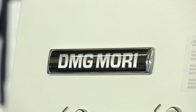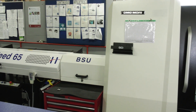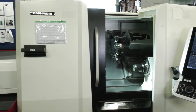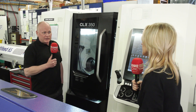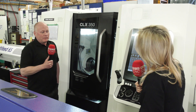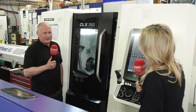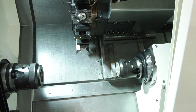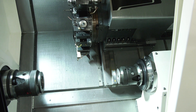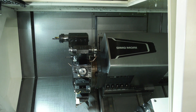I know you're very happy with the machine. So the machine is sitting in your machine shop now, but what was the reason? You've got a machine shop full of sliding head machines — what does this one do that's different? We've always had turret machines, a couple of them, and this was a replacement. It's more efficient, it does more, it finishes the parts complete for us. The previous turret machine didn't do that. It's got sub-spindle, live tooling, and it completes the parts completely in one hit.